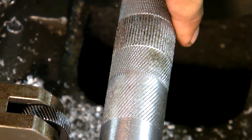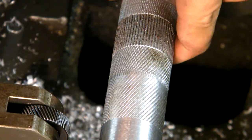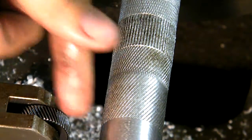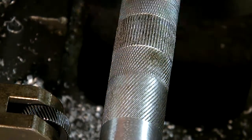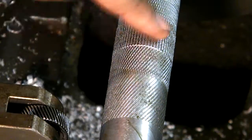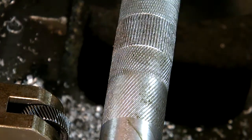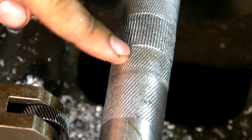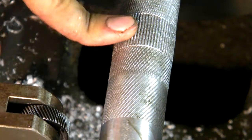There is another pattern which is odd — one of the wheels has straight lines and the other has longitudinal lines, which makes a pattern of squares, but that's the most odd one. From all this knurling the piece is oily, still full of oil. You can see why you need knurling on a piece: here you have some grip, and here you have maximum grip — you can see I have marks on my hand. This other one is very nice too — grippy, but not as grippy as this one. If I sometimes need grip for twisting, I think the cross pattern is the most useful one. But if you need to pull on something, the angled one — at first I didn't like it, but now I seem to love it more than the others.